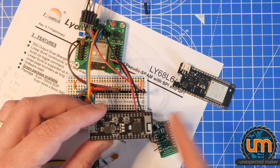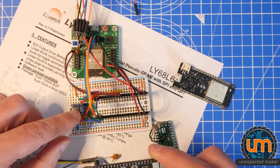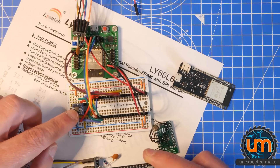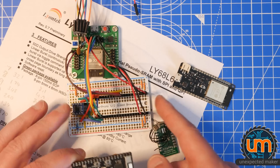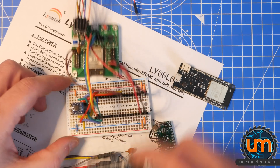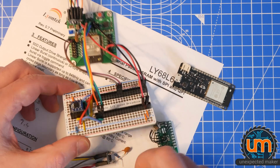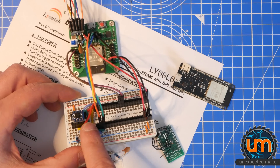I eventually found a set of pins that actually detected the PS RAM. The problem is, it detects it but fails the memory test. It only fails on between 33% and 38% of the read-writes — it's different every time — and the rest it passes. That sounds to me like a timing issue, and it could potentially be a timing issue because of the length of the wires I'm using. But interestingly, if I use the PicoKit on this board without the long wires — the PicoKit sits directly into the pin headers — I get about a 30% fail rate on my read-write tests.